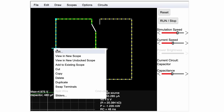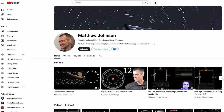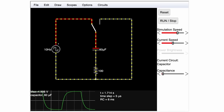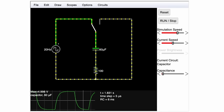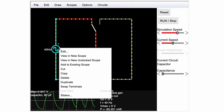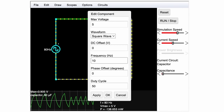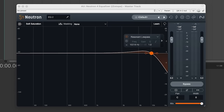Let's switch the DC source to an AC source and observe the impact of capacitance. I learned about this visualization tool from Matthew Johnson's YouTube channel — I'll leave a link to that video below. We'll start with a 10Hz square wave, which alternates 10 times per second. The graph is slowed down so that we can actually see what's happening. Remember, the capacitor takes some time to charge. If we increase the frequency to 20Hz, it barely allows enough time for the capacitor to charge before switching back. When we double the frequency again to 40Hz, there isn't enough time to facilitate a full charge, and the frequency is attenuated by the capacitor. The higher the frequency, the more this attenuation will occur — you can see that with an 80Hz signal, and even more so with a 160Hz signal. For this reason, capacitors are used in analog low-pass filters, which are tools that remove energy above a particular frequency.